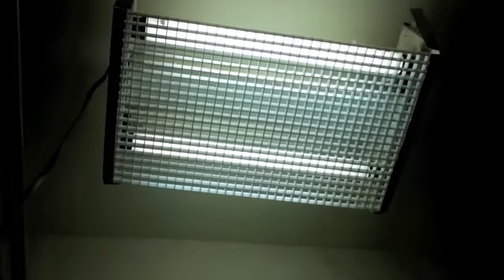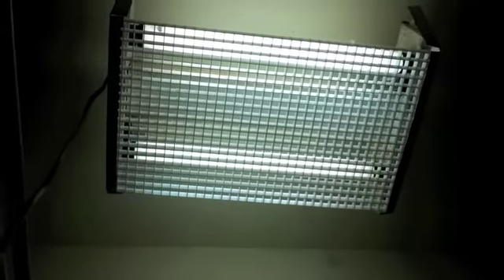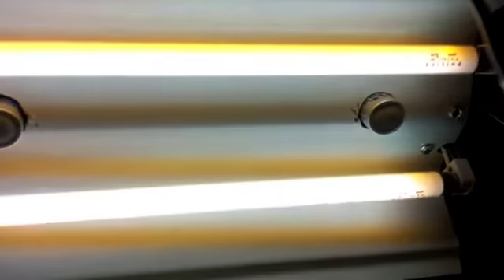That fixture is a homebrew lead-lag setup. There's a capacitor in series with one of those chokes to make it high power factor, as well as a third choke to act as a starting comp. That switch controls more, by the way. F8 T5 mini shop light, homemade. I also added a capacitor in series with one of these chokes, but found that I didn't need the starting comp on this one.